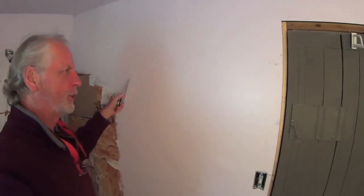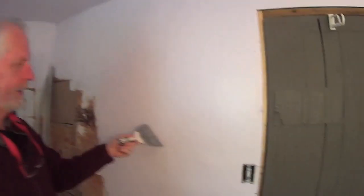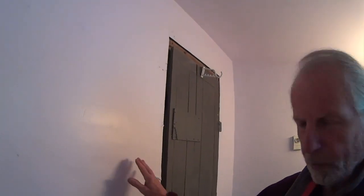Getting it on as thin as I could and spreading it out — a lot of times I used kind of a circular motion. You could go for that kind of effect if you wanted. Back in the day in the 60s, all the new houses had sort of a Spanish finished wall with a circular motion on it. I guess you could go for that kind of an effect. It took me three coats; the third coat was just a light skim coat. I'm going to hang a bunch of pictures in here and I think it's going to look okay — I do think I have kind of a Mediterranean finish there. A friend of mine had a good tip: instead of sanding, using a really damp sponge just to smooth things off. If I do this again — and I might do a few more walls in this building with this method — I'll try that.